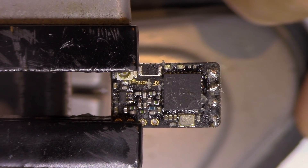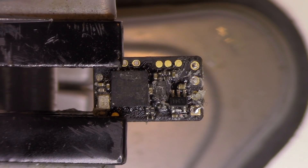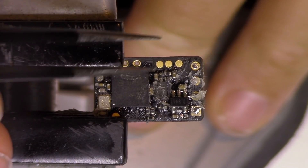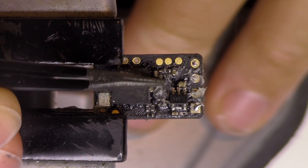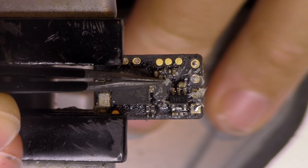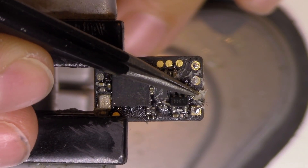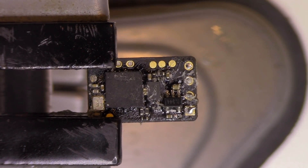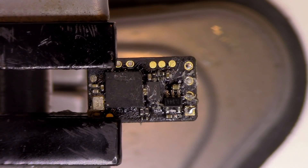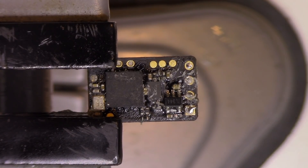The first thing I'm thinking about is the voltage regulator, which most definitely is a 3.3V reg. I am so very lucky because Chris did a nice job coating the receiver with some hot glue for some reason — so yeah, stop doing that. I power up my hot air station, set it at around half airflow, temperature around 380°, and let's take this voltage regulator out.